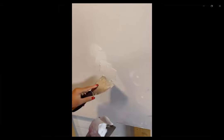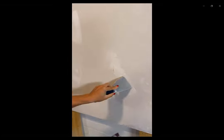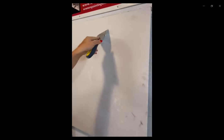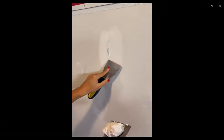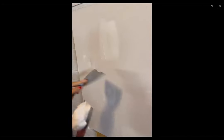So for the long one again, she applies it thick and kind of messy from beginning to end. Don't worry about making it perfect when you're applying it like that. You just apply and then remove — two fingers on the putty knife. Don't forget. And nice and clean. She likes one finger, I put two — it doesn't matter, as long as you have a finger on there. Now the drywall tape one — once again, more towards the right and left, a little less in the middle. Clean up your spatula nicely. And then you start to clean it up from the right, from the left. And that's it — this will need a third coat. Sometimes it doesn't — it depends on the patch. We'll be back when everything's dry and ready for sanding and clean up.